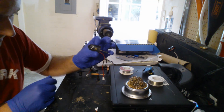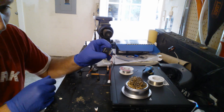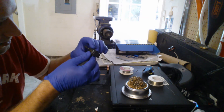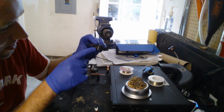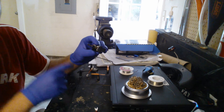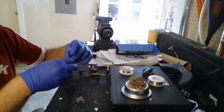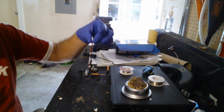This has to be set on channel 8. The TX5805 comes with a little instruction manual. It's upside down here — the first two jumpers are up. On the second part, jumper number one is up and jumper number two is down. That's channel 8. You can flip through your channels on your Fat Shark and it will work — I promise you that. I've already tried it out and it works fine.